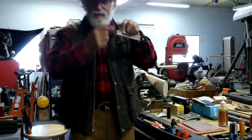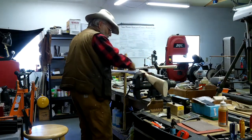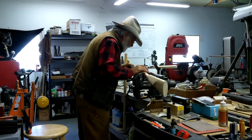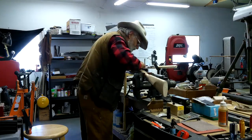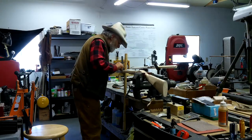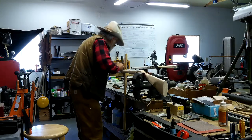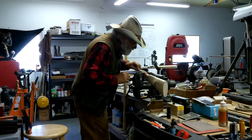This has to be straight up and down against that flat. If you lean it towards the outside of the rifle you end up getting a gap between the barrel and the wood, and it still won't go all the way down. I've got to keep that straight up and down so those sides will form level with the barrel when it goes up. I've marked it here and it's mostly on this side where it needs a little more coming off. I found that hump in the center and took it out.